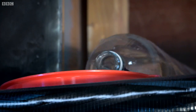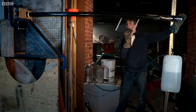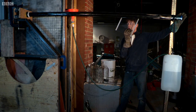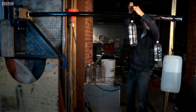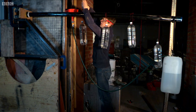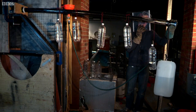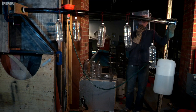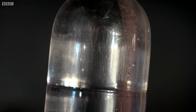Now I'm nervous. I want to see how close to breaking those wings are going to be. It's definitely a fair bit of strain in that. With our only spare piece of wing spar, I'm going to simulate the forces I think it'll actually take in flight. If it can take 25 kilos of water along its length and at least half my weight on the end, then by my calculations it should at least survive take-off. The question is, how much more can it take?